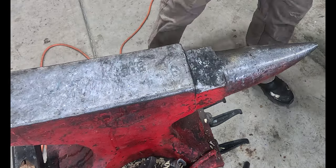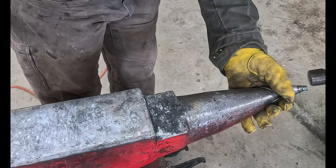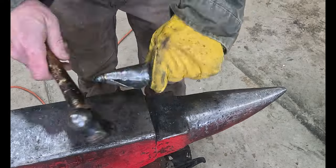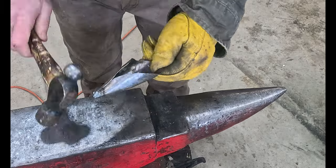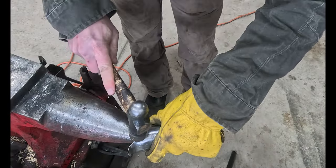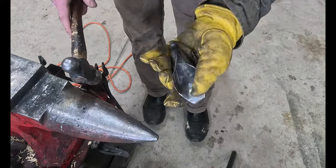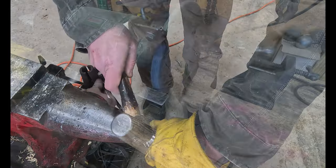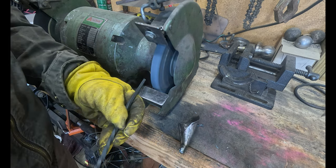And here I am rolling over those drawn-out tips just to create kind of a curlicue on the bottom of the stem. I like the way that looks — it just gives it a little personality. I'm pretty confident 'curlicue' is the exact scientific nomenclature used when talking about these plants. Being self-taught, I'm constantly learning new terms and techniques. But when you're smoothing out metal surfaces that you've brought to a particular form, it's called planishing — that's what I was doing there, just trying to get the little lumps and bumps out.